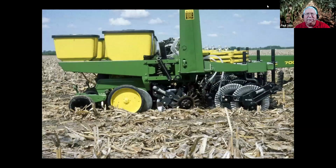Show you this planter, a friend of mine in Illinois. He was working with Yetter evaluating their triple coulter system. And when it comes down to it, the 2 coulters up front, put down some fertilizer, did some tillage. He had to put a residue mover on there to kick out the incorporated residue from the tillage. And then he still felt like he had to do some tillage to get the seed in the ground. But look in the front of that planter. There are 12 John Deere rear wheel weights across an 8-row planter. And it's not 8 rows, that is 32 openers going in the ground when you count all those coulters. And so again, we got to think about it. How much do you have going in the ground?